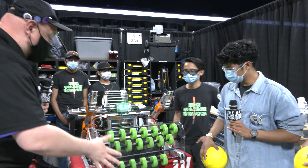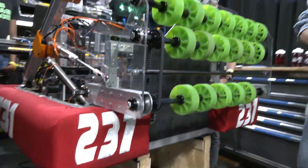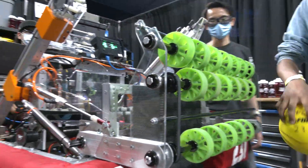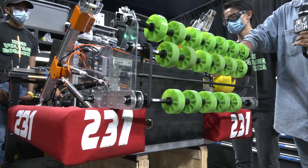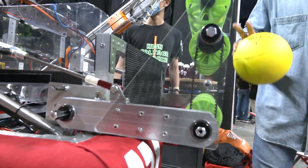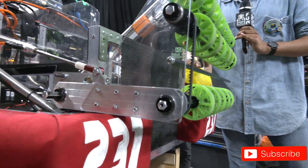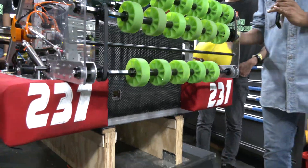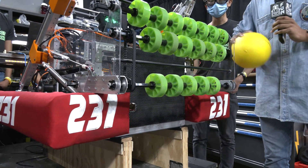David, let's talk about the intake. There are lots of compliant wheels on here — tell me more about that and the hopper. We started with the design process. These plexiglass three-eighths-inch pieces were cut out by a CNC router. We wanted to keep things simple, so we let it roll up onto the back wall with a mesh taped onto it. The pulleys run from the top all the way down to the bottom, and the motors are placed inside the robot to save space. We wanted at least half an inch of compression so the ball flows freely into the robot.